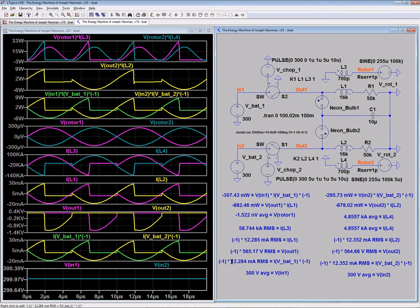Problem is that averaging is not good unless you're just doing a DC, which is almost like saying nothing, especially if it's a flat DC, as opposed to rising or falling. So I really don't need an average here, I put it in because it's just flat lines. But everything else goes up and down. If you take a true sine wave and you take the middle, it's 0. It's only when you take waves that are complex, that undulate up and down like a sine wave but are no longer a pure sine wave, that RMS really is a good idea.